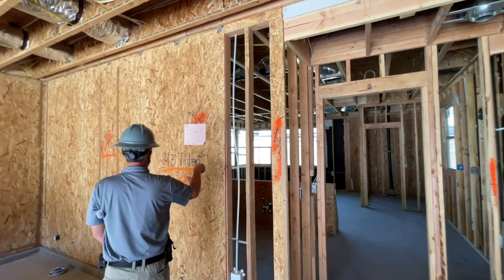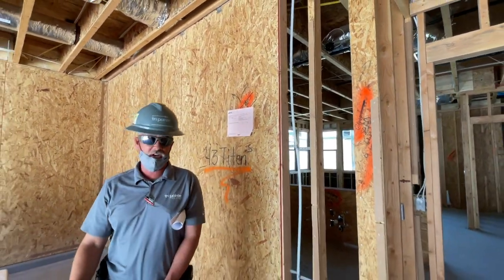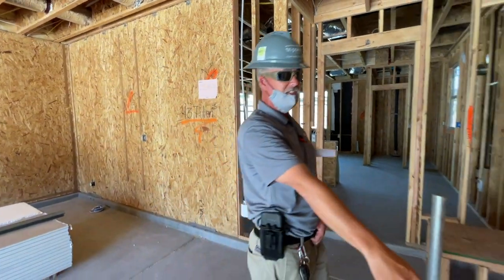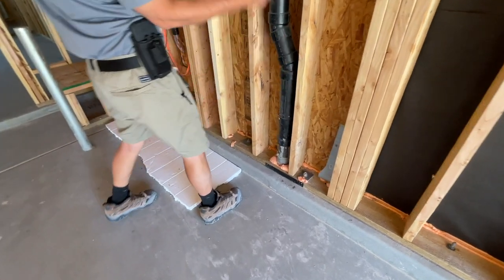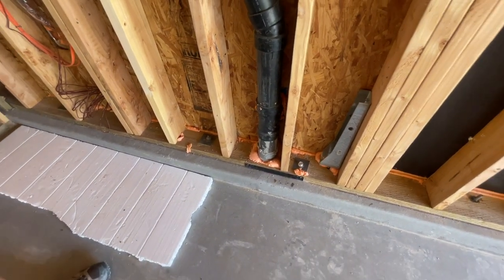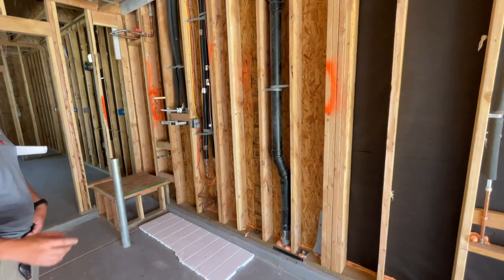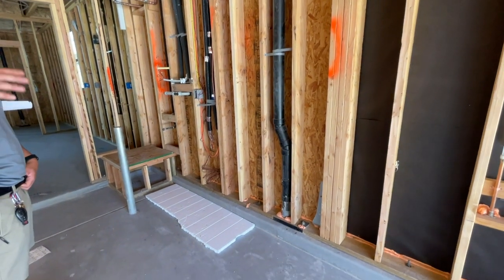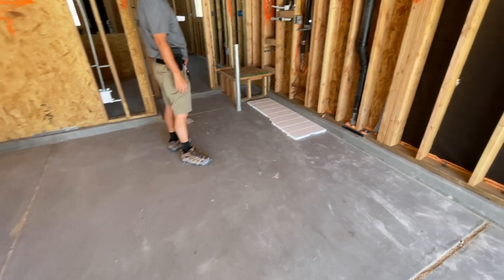When you see the shear walls like this, these are load bearing walls bringing extra strength down. You'll notice on those walls heavy steel hold downs to hold down the house in earthquakes, one on each side of the walls. Extra bolts to bolt the house down to the concrete. Concrete 7.5 inches thick, 4,500 PSI concrete with steel cables running every 2 feet from the front to the back and from the side to the side.